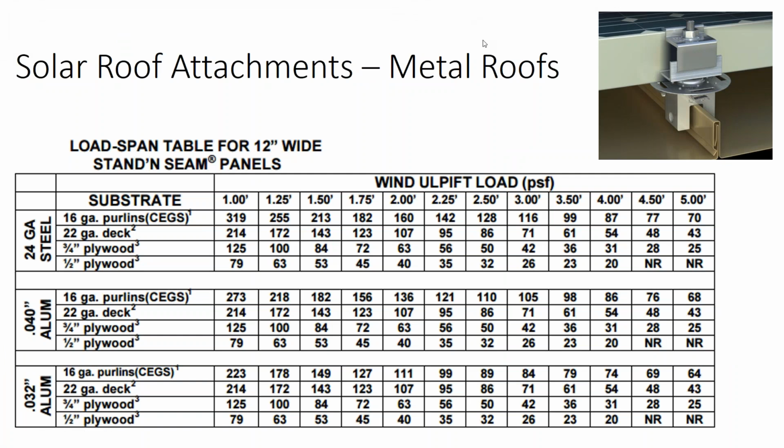That's just the problem with standing seam metal rooftop systems: if you use a clip and then you use a rail, and that span goes 4 feet or 6 feet, the panel itself may only be a foot and a half wide, or common to be just under 2 feet, like 18 inches or something like that. And if we're at 18 inches on top of a plywood substrate, our uplift force can be based on what the substrate is, the strength of your panel, and how wide that panel is. You can get substantial weakening ratings on that panel.